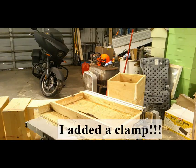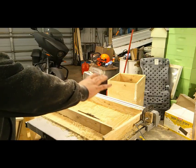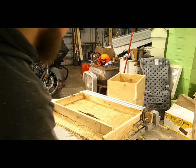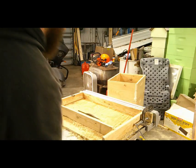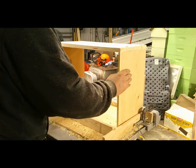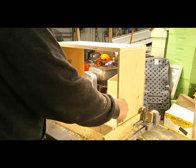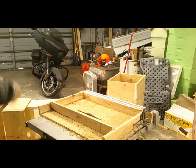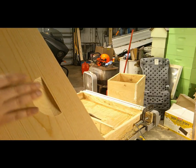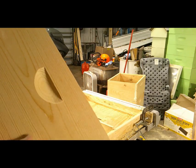After doing a few of these I figured out something: to get it nice and smooth where you won't have to sand it, after you do your first initial plunge cut, you come up on those half moon pieces and go down with it, then just come back up with it. It'll be perfectly smooth — watch this. See that? How nice and smooth it is. So if you go back on your first downward movement and come back up with it slowly, it'll get nice and smooth like that. You won't have to sand it at all.